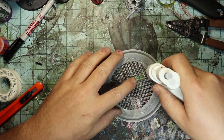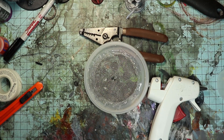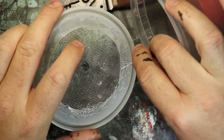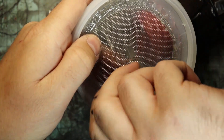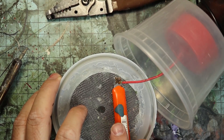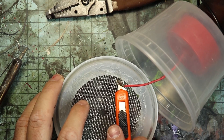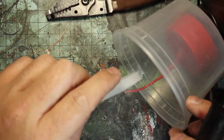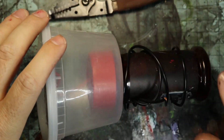I'm going to flip the lid over and put glue on the other side as well. With the lid done, we should have one bare wire left — the positive side of that negative ion generator. I've got the wires kind of splayed out to help make a better connection and hold the lid in place while I solder it, just feeding them through the lid and twisting them back around. Sometimes wire mesh or aluminum oxidizes quickly when you solder and makes a not-so-great connection, so I'm using some soldering compound to help make that go a little smoother. Don't breathe this. Once you get that soldering in place, just pop the lid on and we'll move on to the very final step.